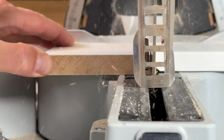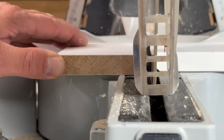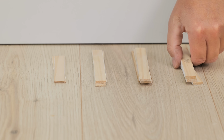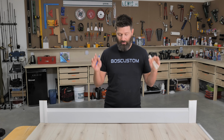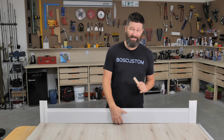You've got your saw out, you're cutting baseboards, chop up some shims, set yourself a little stop block. I like to cut some 32nd, 16th, 1/8, and 3/16 shims. The combination of those shims is going to allow you to tackle any gap, any dip, any hump. So let me show you how to mark out this classic dip scenario.